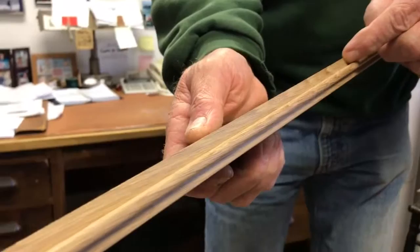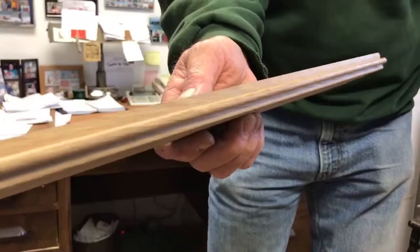Wear layers are very important in wood flooring because you need many wear layers in order to get the longevity out of your floors. A solid oak floor is 3/4 inch thick, and the top of the tongue, this is your wear layer right there. We nail it through the tongue, so once your wear layer goes down and you start to see nails, you know that your floor is worn out.